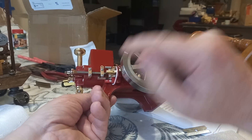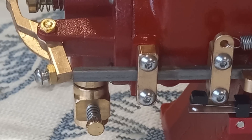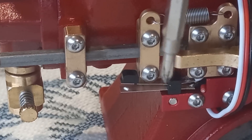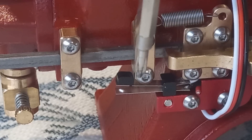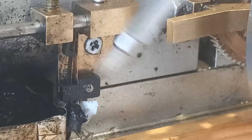One of the things you'll notice — it's got a little mechanical switch here, which will only let this machine fire when it's supposed to. I've put that kind of switch on my engines before — the mechanism I added to this hit-and-miss engine, the bracket I made, is from a CD player. That makes sure we're not wasting spark every time it rotates, only when it's needed.